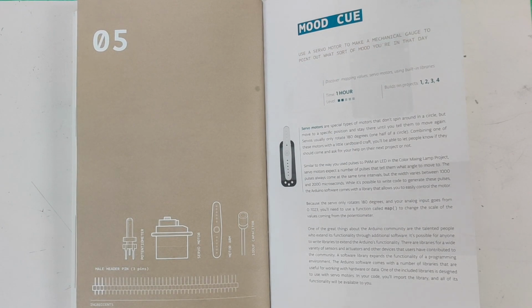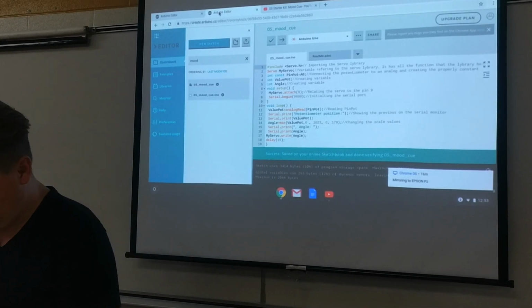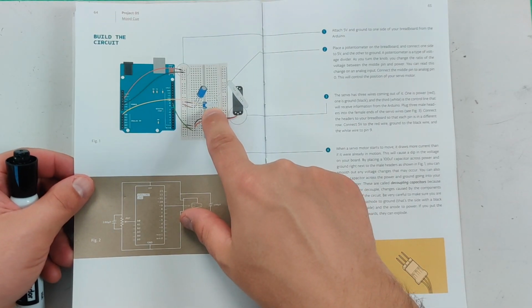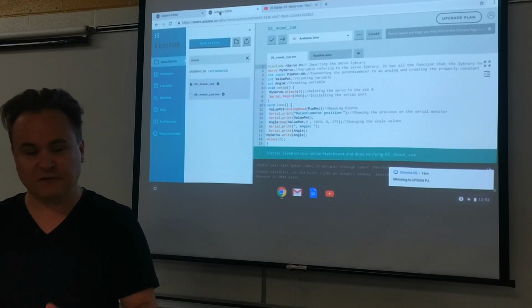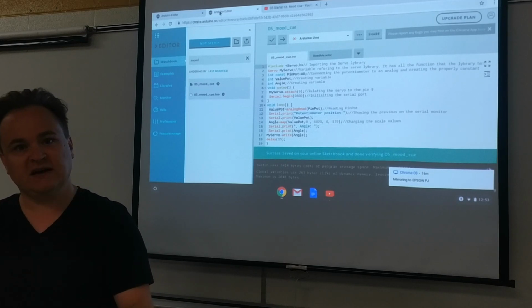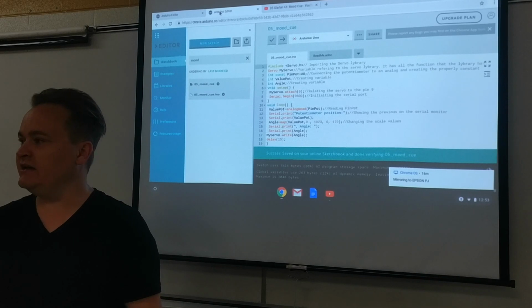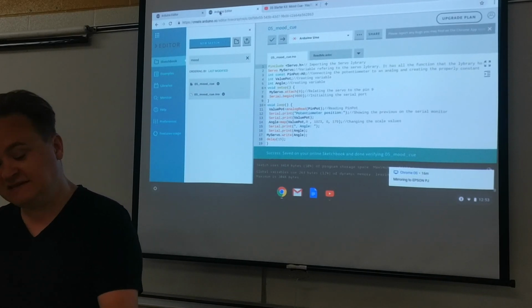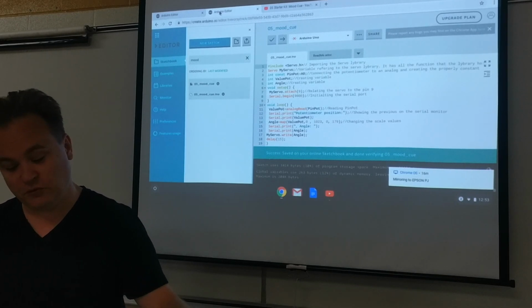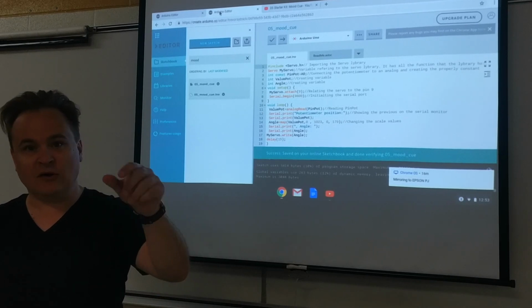So you can read about servo motors, and then you've got to understand another thing, that we need to map the function. We're going to use something called a potentiometer, a pot as we call it, and that's kind of like the other things we've used. It's like the photoresistor that took a signal of light and converted it to a voltage. It's like the temperature sensor we used that took a temperature and converted it to a voltage. Now we're going to actually use a twist knob that's going to allow different amounts of voltage.